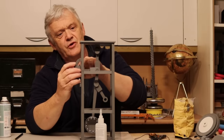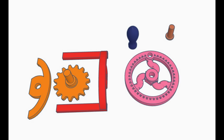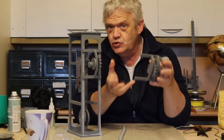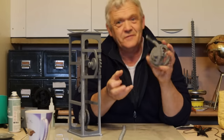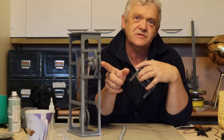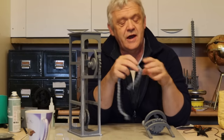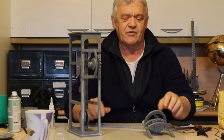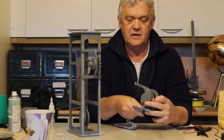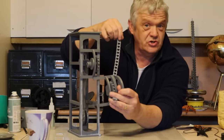Now we take these parts and put them together as a module. There's the brace part, a support bar, a gear in between the two, then a wheel and a handle so we can turn it — though you could just replace this with a motor. I quite like hand-turned stuff, so I've done a hand turner. That takes the place of my constant-rate power input. To join the two sections we need a chain — print off 33 links, they snap together, and we feed the chain in and glue it on with a little positioning to make sure the chain is tight.